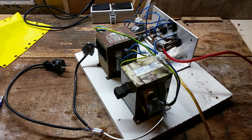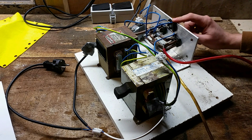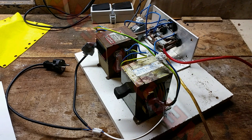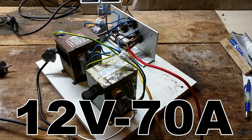This is my very dodgy transformer, made from two old microwave transformers. I removed the secondary coil and replaced it with two parallel electrical wires. They together make 18 windings and produce about 14 volt AC. These diode bridges transform it into DC current, and these capacitors make it all nice and flat. There's an output voltage of 12 volts and it can handle about 70 amps.